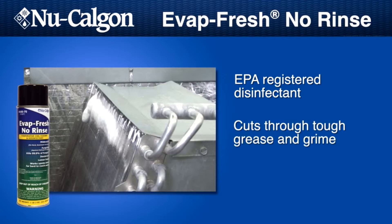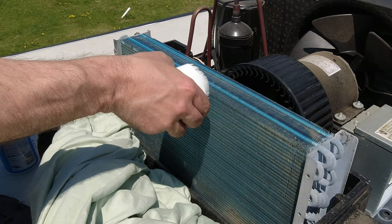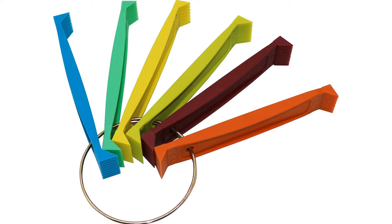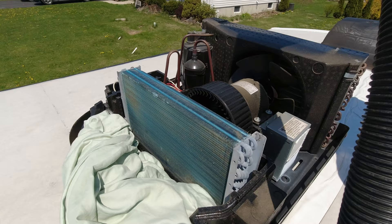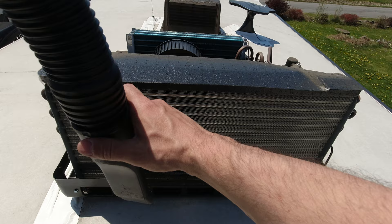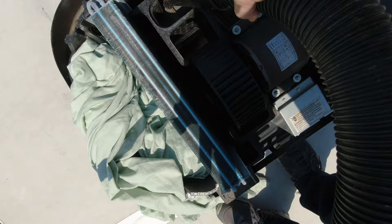Before we use any cleaner, I'm going to use the brush that comes with the Frost King cleaner and just go straight up and down to get out any loose dirt or dust from the coils. There is some dirt and dust coming out of these coils as I push this brush up. If your coil fins are bent badly and you need to straighten them, you can get fin combs, but honestly try the brush cap first — it actually does a great job straightening out the fins. I'll use the brush on both coils, and then I'll take a shop vac and vacuum out any remaining debris from the fins, and also spend a couple minutes vacuuming around the unit and cleaning out the drip pan for bugs, cobwebs, or dirt.